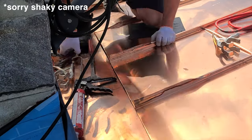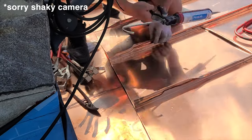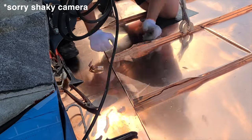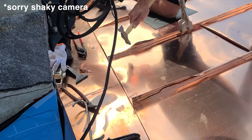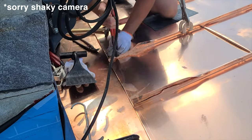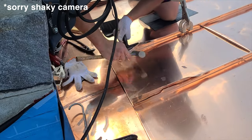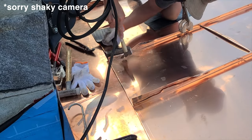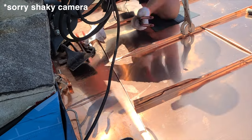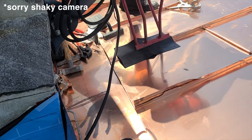It would be virtually impossible to double fold the seam end if pre-bent. So to close off the ends of each seam, I am double folding it. Here I'm transitioning the height of the seam down and now I'm double folding it over, and then after that it gets crushed down again. So it's a double-folded, crushed, laid-down seam that's only three-eighths of an inch in height.